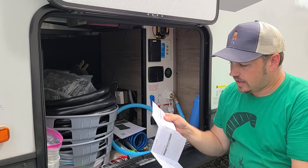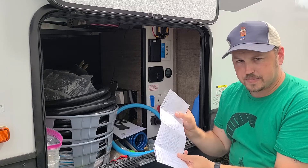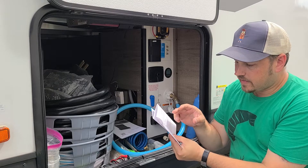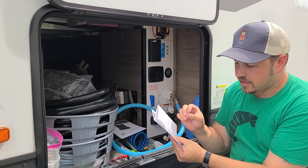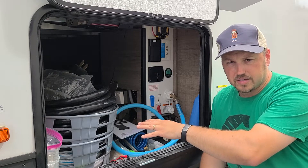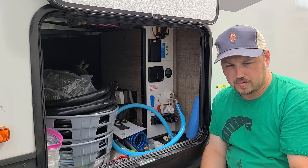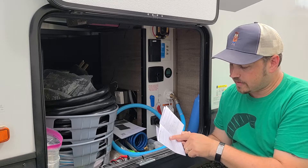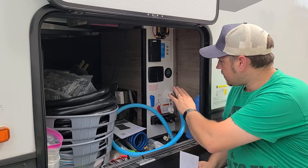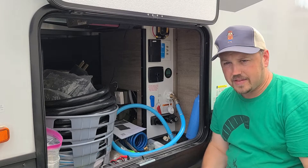So you want to find this little booklet — you can also look it up online, Furion's website has it as a download. It talks about mounting, checking, where the inline fuse is, and on the back gives the specifications. Specifically under 'Set Up and Operation,' it talks about how each battery has a capacity measured in amp hours, and for accurate use the meter needs to be calibrated and set up for your battery capacity. I have two 6-volt deep-cycle golf cart batteries in series, giving me 12 volts and 225 amp hours total capacity. It goes through a seven-step process — very simple — to configure the battery monitor to read correctly.